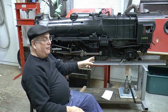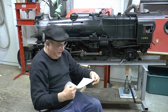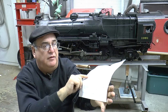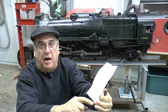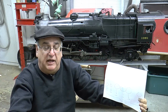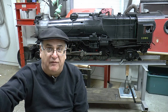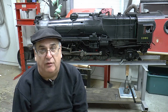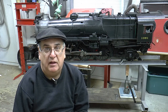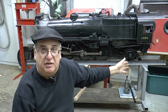You could actually add all these up. What I did is make a little drawing — kind of a quick rough sketch — and I just wrote down what the numbers were. If you add them up, that's the weight of the locomotive, pretty close. Comes out to 800 pounds. So the tender was probably 400, which would make it 1,200. Figuring the water and everything else adds about another 300. So it's about 1,500 for the engine and tender. But the tender and me don't count as traction, so it's only the locomotive that matters.